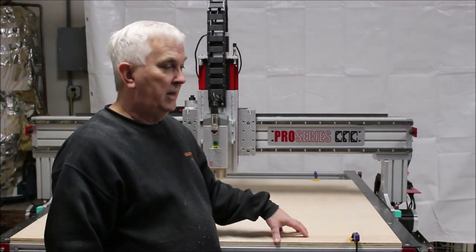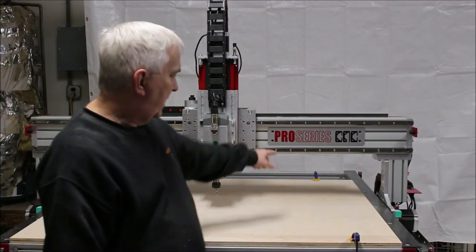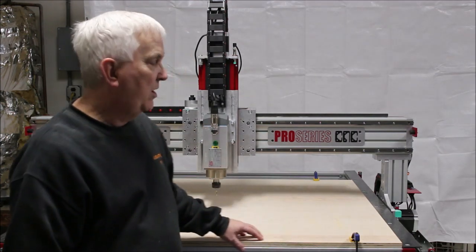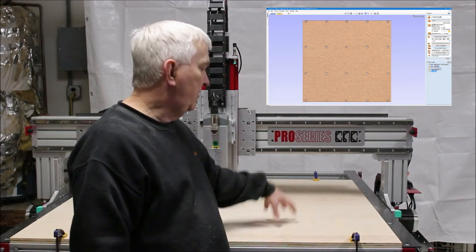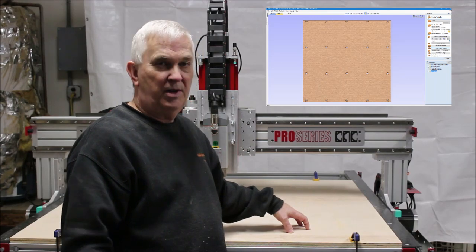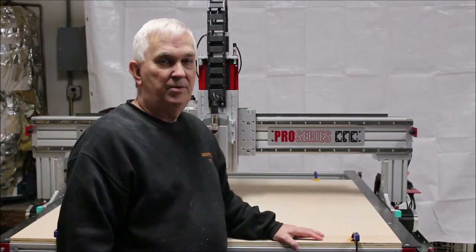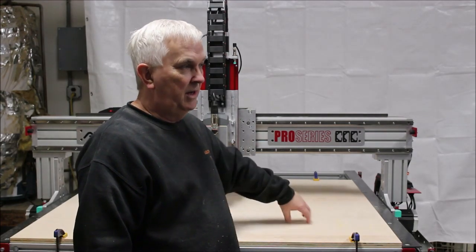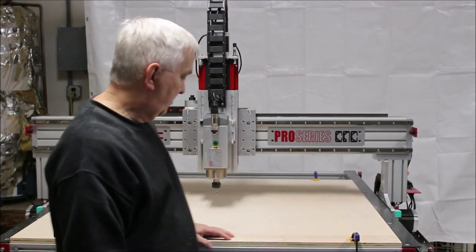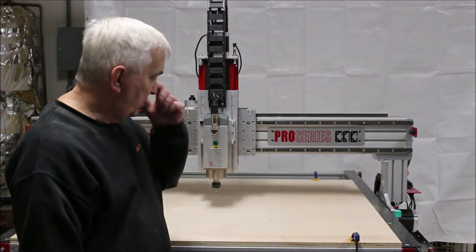Since plywood only comes 48 inches wide, I cut this one 49 inches and have the 49 along the X, and it goes back only 48 inches instead of 50 inches, what their program calls for. So I've had to tweak the program a little bit, and I'm leaving out those other big slots and the threaded insert holes, because I'm going to be using aluminum T-track and then MDF strips on top of this.